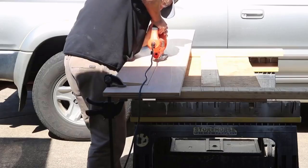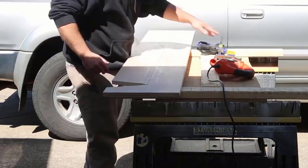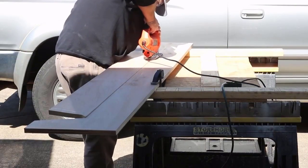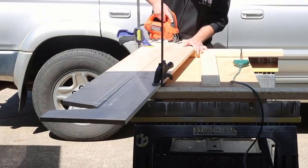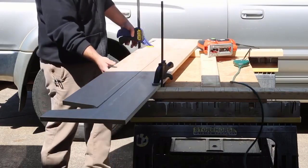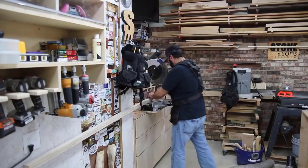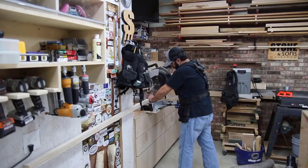I'm going to be adding in some angled legs. I'll cut out all of the sides and ends with a jigsaw to give me my leg profile. One thing I learned through this whole process was that I needed to just trust the jigsaw and let it do the work. I tried to rush a couple of cuts and my blade started wandering — you just have to let the blade do the work itself and guide it along the path.